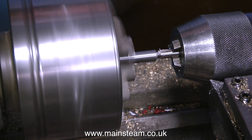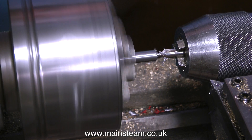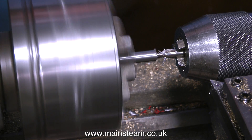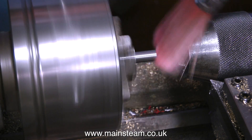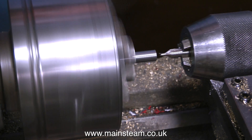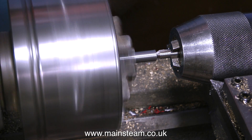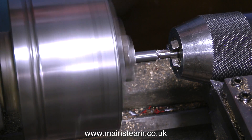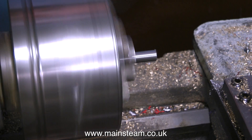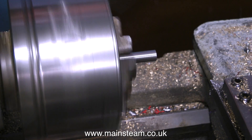Full-size crankshafts generally have a center hole in the end of the shaft, and if I was making this crankshaft from a casting, the center hole would be functional to hold it in line while I turned it. But I really don't think my lifespan is long enough to turn a crankshaft from a casting. It's something I've never done, never needed to do — I've made some pretty big and some very small crankshafts using this built-up method, and it always works.